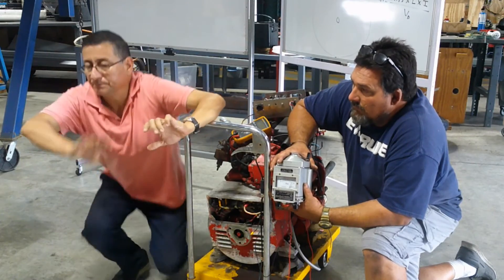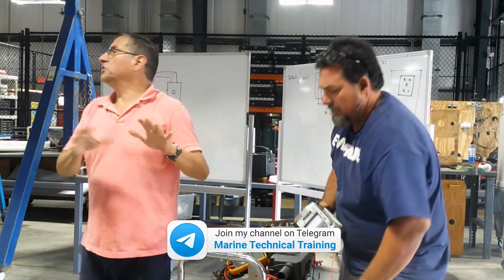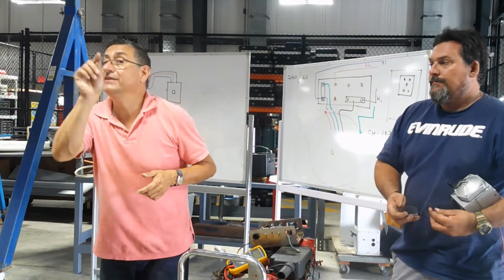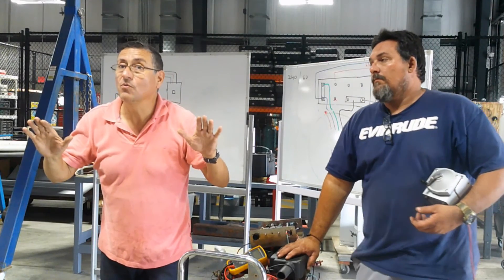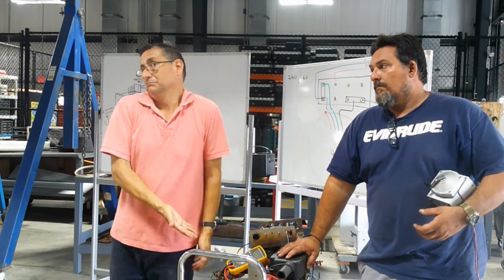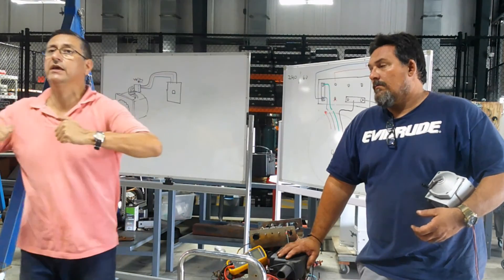That's the meg. With that, I demonstrate to the customer whether your generator is good or not. Mr. Lopez, once again — you said the generator in single phase equipment works if the load is low, but when you apply too much load, the generator shuts down. The winding is not good. One winding is marginal and the other one is zero.